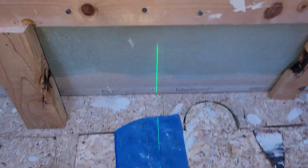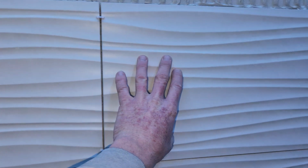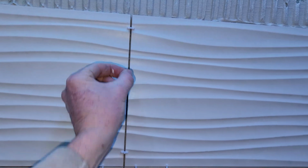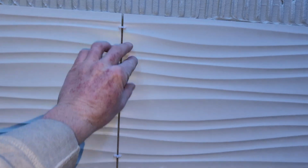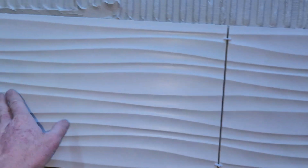Now, a tool that I'm actually using, which is really helping out, a lot of these tools were actually from my dad from his tile job. And what I do is, after I collapse those ridges with my left and right hand, I scoot this tile, or whatever tile I'm working with, all the way over to the tile that hasn't been set yet, which squeezes this line right here. Then I use my damp sponge, I wipe it through. And if I have any boogery hanger things, I just scrape it through and wipe that on my sponge. And make sure you wipe up any drips or any thin set that has gotten on your tile, because it's going to be a lot trickier to remove that as you're working your way up and it hardens. So definitely clean as you go.